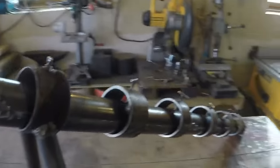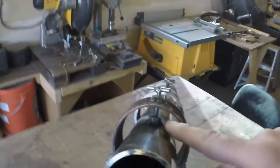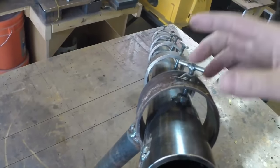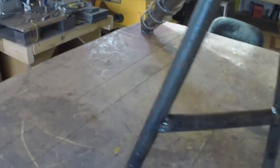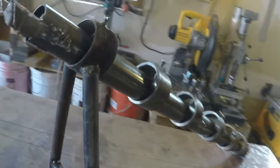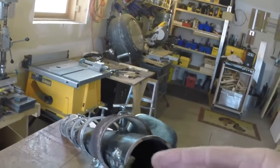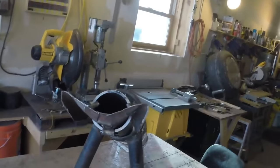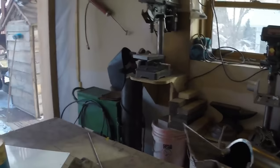All right, over here, I did have to weld another nut onto this thin piece of pipe, so that's done. Notice that there's a nut welded down here too. That nut is just a hole to catch this, because this is now a mount. I don't want this to get away. So you can see I built a basic little A-frame. So there's the frame, nice, simple. And then the little funnel piece, which I just grabbed some more of this junky steel over on the table and bent it into somewhat of a funnel shape. And then, I don't know, I ended up with that. I welded a piece down here, just bent these pieces up, and hopefully it's the right height and the right angle and all that stuff.